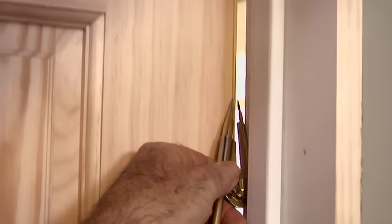The last thing I do while I have the door near the opening is measure the distance to the lock strike and subtract an eighth of an inch from that measurement. I hold my tape measure up against the top jam and it'll come down to the lock strike if there is one. If there were one, I'd measure to the center of the lock strike, subtract that eighth of an inch for head gap, and write that measurement down right on the lock stile. Now all the measurements are right on the door — if my door bench is in some other room, I won't have to come back to this opening. When hanging more than one door in a home, instead of writing an X I'll put a number on the door and the same number on the jam, so I can scribe a whole bunch of doors and process them all at the bench at the same time. I used to watch Royal Schaefer scribe 30 doors — sometimes even more — before he'd even start hanging one.